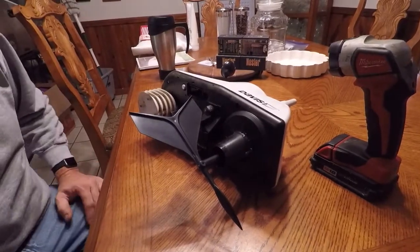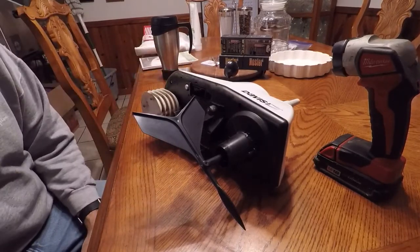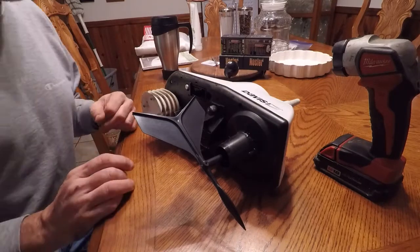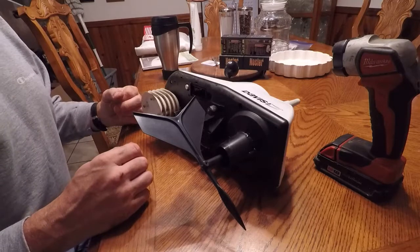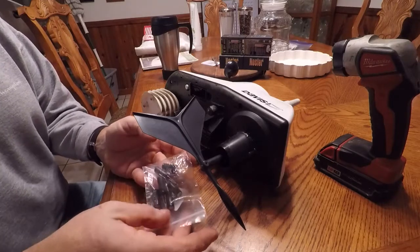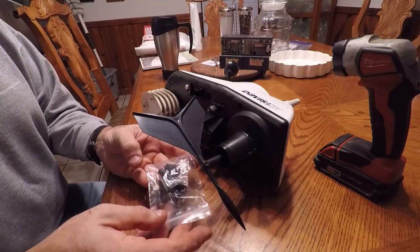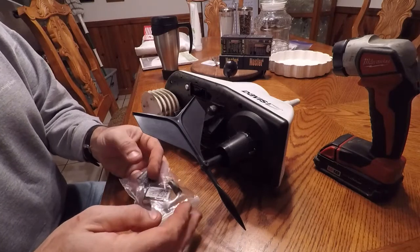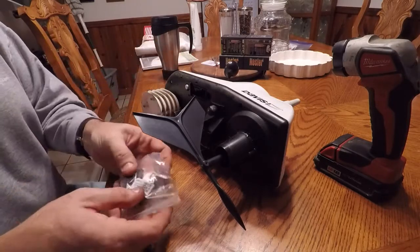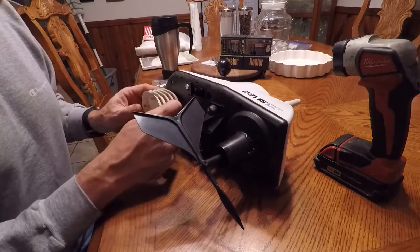Over the last year it lasted about a year, and then I got a low battery warning. I put a new battery in it and that lasted about a month and I got another low battery warning. I put another battery in it and that lasted a few weeks and I got another low battery warning. Something's wrong. So I started doing some digging, and apparently there is a 10-farad capacitor on a board in here that is supposed to get charged by the solar panel to run this thing overnight instead of using the battery. But that capacitor has apparently failed.